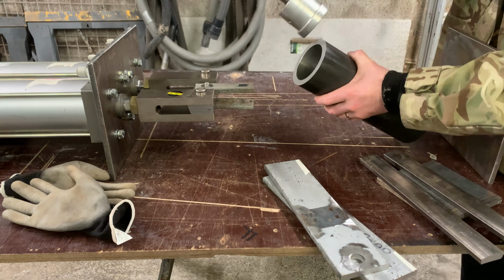So the idea is I'm going to have a trap door there. There's a few little bits there that are going to hang on to hold this plate in. So when I'm ready to eject the core, I'll slide this plate out, expose the hole here, carry on pushing the ram, and out comes the core onto a third shelf, this here.